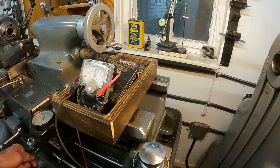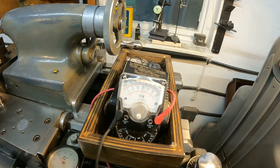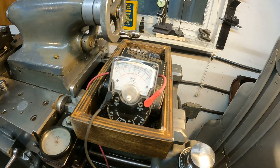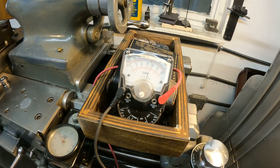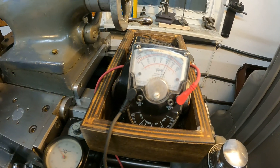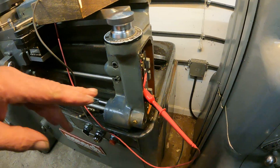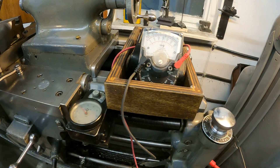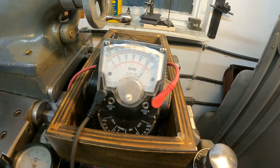Let's get the machine in neutral — you can see it has a reading there. Now let's put it in forward. Okay, get my hand on that. Get it in neutral, then put it in forward. You see where the needle went. Back to neutral. Now to reverse — you see, it didn't move as far in reverse. There's neutral, there's forward. So you can hook up across the switch and detect all three positions. That would be harder with a digital because it's going to flash numbers; with this you can see it with the needle.